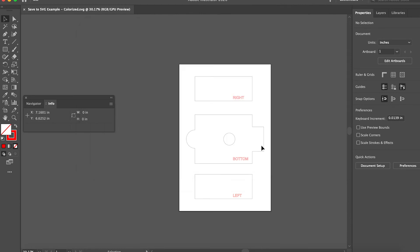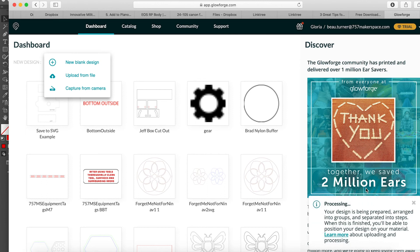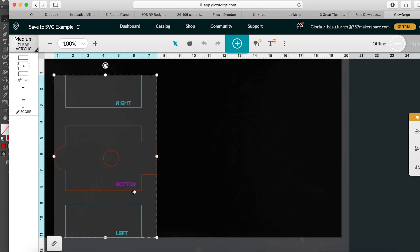I'll go ahead and set the text all to red. That's going to show that I have my text separated. Keeping it just like it is with no other changes, I'll save this as an SVG — I'm going to call this dash colorized. Now loading that colorized SVG file into Glowforge, that allows me to have more control. We saw a moment ago when I brought everything in, I only had one option to select. Once I've colorized it — simply selected my items, changed the color, and saved it back out as an SVG — now when I load it into the Glowforge, I have more control. I'm going to take the parts and pieces and set those to cut, and set the text to score — I just need it light to understand which parts go together for this prototype.